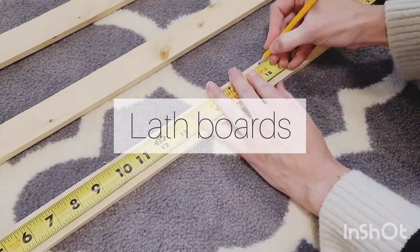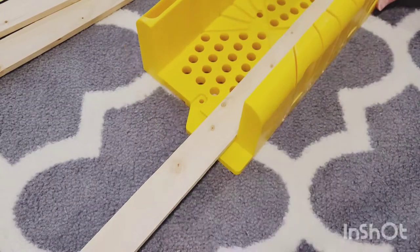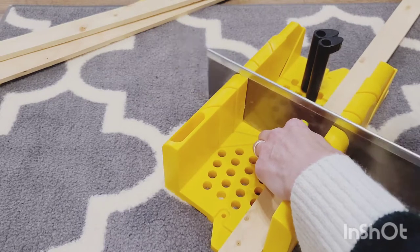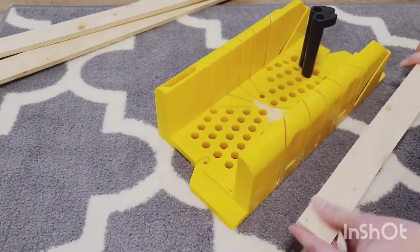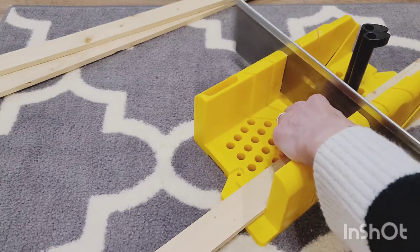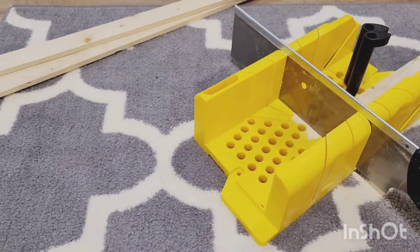The first step was to set up my snowflake, which told me the size of the plank backdrop I would need. I went ahead and cut 18-inch long boards and 19-inch long boards, because every other board is going to be a little bit smaller — it comes in half an inch on each side. So wear a glove; it's a lot of cutting.